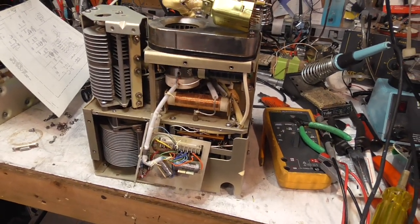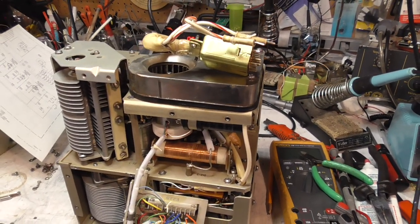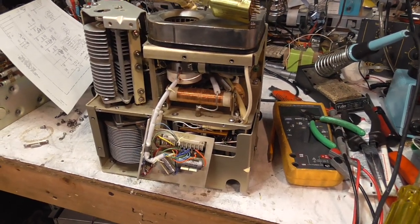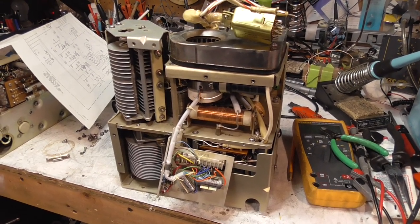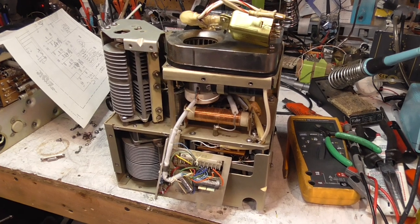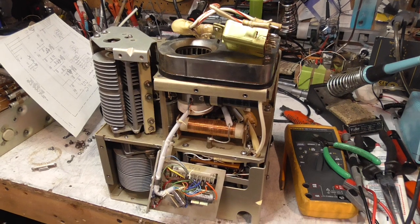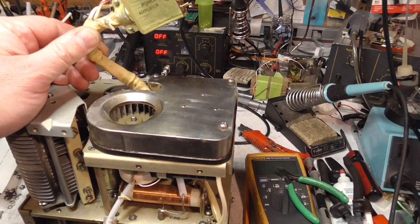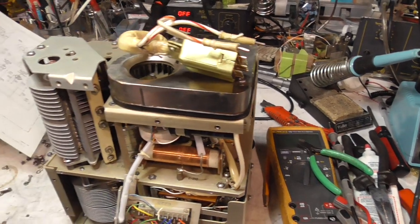This is the PA section I have removed. We're trying to figure out what the failure was. As we've been working on this, we fixed a shorted capacitor in one of the low-voltage solid-state dynamotor and replaced a few tubes, but there was still a problem. It turned out to be the PA blower here — it wasn't operating.